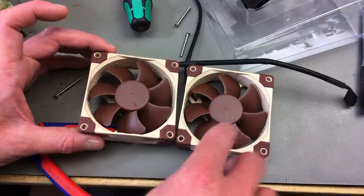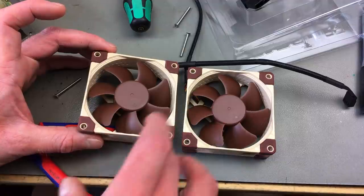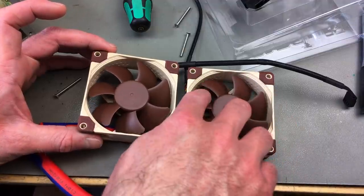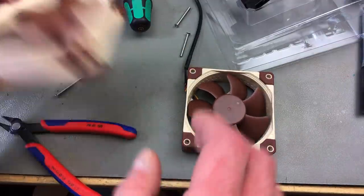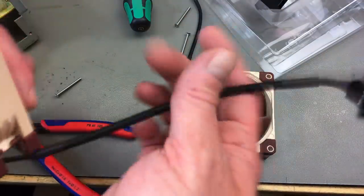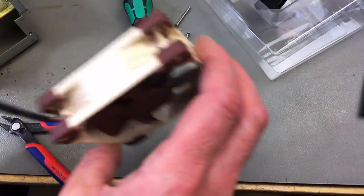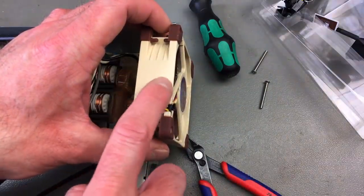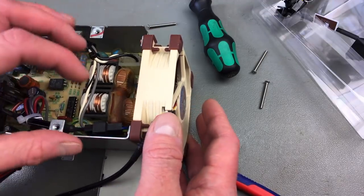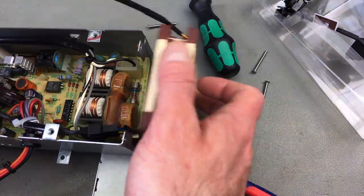Okay, and I was wrong about the ultra-low noise one having fewer blades or anything like that. They just look absolutely the same. They even have the same little engravings on the fans. But this says PWM and it is a 4-prong connector, and the other one is a 3-pin connector. So we are going to use this one in the same orientation, I would guess. Yes, the airflow goes outside. I don't know if you can see, there's a little arrow for the airflow on this as well, of course. So we can put it like in here. Now we should put it like so.